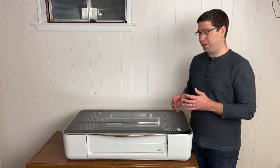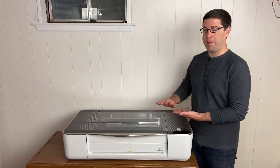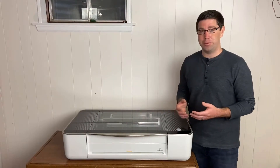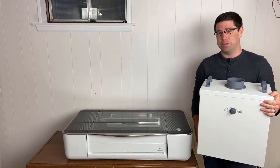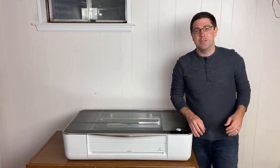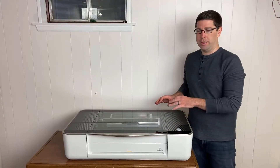Safety is a really important topic with the Glowforge. It is a very powerful laser, so be careful with reflections — if you have something shiny, mask it to prevent reflections that could damage your machine. Be careful with dangerous fumes from cutting materials such as vinyl, which can create a dangerous gas. If you don't have a window, use their $1,000 filter. Also be aware of fire risk: loose debris can ignite, so Glowforge really recommends watching your projects and not leaving them unattended.